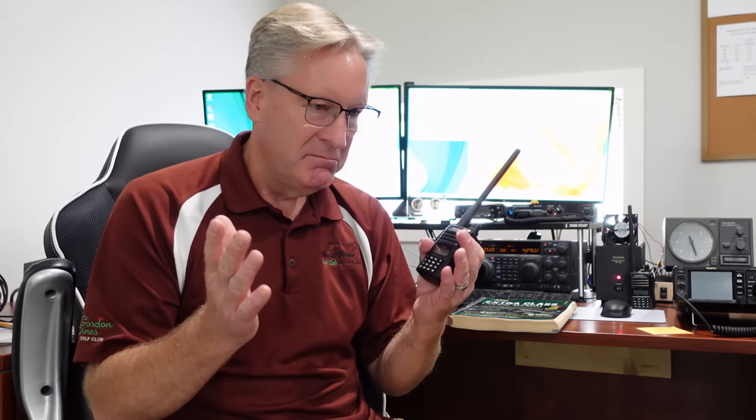There are repeaters — another radio that listens on one frequency and transmits on another. If you go through a repeater, usually located at a high location, that will increase your range to maybe 50 miles. So in a normal emergency where the repeater is still going, you'll be able to communicate out to 50 miles with friends if they have the same frequency programmed. But if stuff hits the fan and the grid goes down, do the repeaters have a backup generator? Most don't. Some are tied in with cell phone towers and have some power there, or a generator — maybe lasting a few days. But most amateur radio repeaters are owned by a club or an individual, and they probably won't keep running indefinitely.